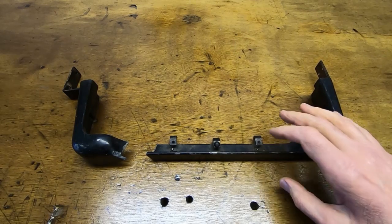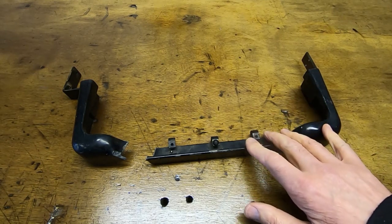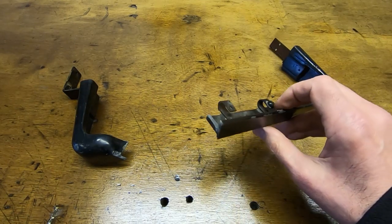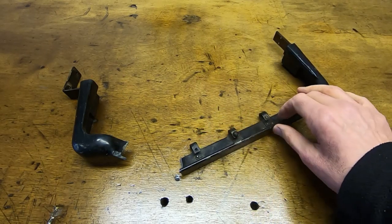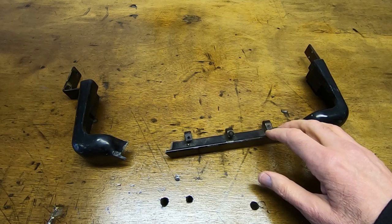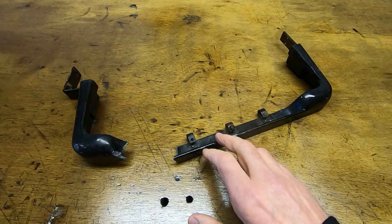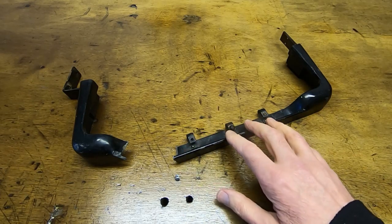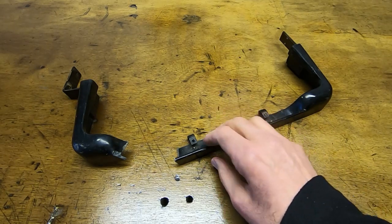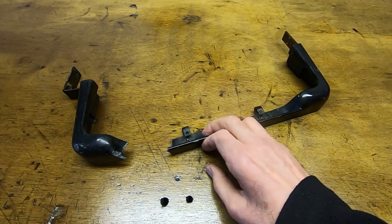In the previous video in this series I went over how I was setting up the welding equipment for repairing this cast aluminium component. It's part of a reperforator — it's very old and very porous cast aluminium. The method I'm using is TIG welding, and I demonstrated the general method in the previous video. I can't really show the welding in this video, but there are probably other methods you could use. In my opinion, welding is the best way of repairing this.